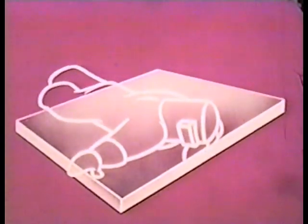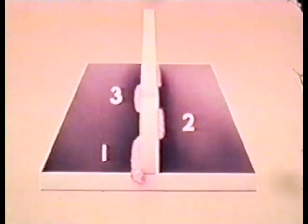This rule applies automatically in welding a machine base, where its own structural nature provides rigid balancing forces. But when these natural balancing forces are not present, we can place Shrink in the position of using his own powerful force to balance itself. Use proper welding sequence. By welding alternately on both sides of the neutral axis, Shrink has to pull on one side, then march around to pull on the other side, then back again — until we have Shrink tired out completely. The result? No distortion. Here's another application: staggered intermittent welds, applied in sequence.